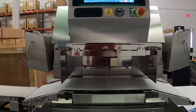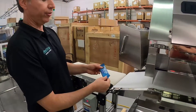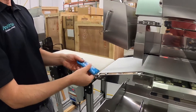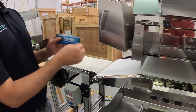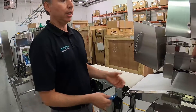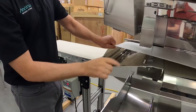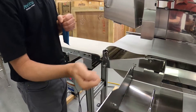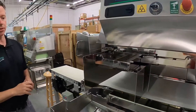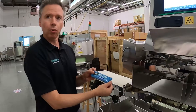The beauty of this system is that on a lightweight product, if we had conventional curtains sitting down to act as shielding, they could interfere with light product — it might not run through properly and could cause problems with rejection. This is a touchless solution, so whether your product is light or open and unwrapped, we have the same solution. The touchless design also allows very easy cleaning: I can simply stop it, pivot it, pull the door off, pull all the parts apart tool-free, pull the belting off, and even the plates come right out for full access for cleaning.